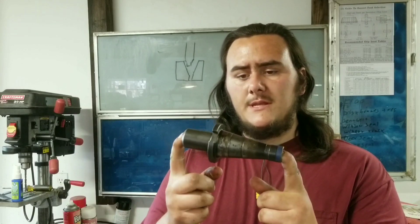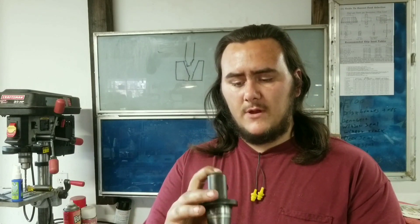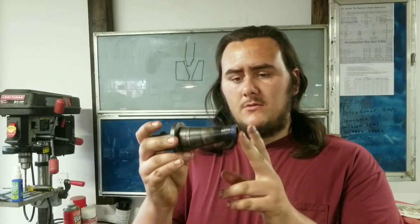With a 40 taper tool holder you would need two-and-a-half inch round steel to machine away and create the taper, and also for whatever feature you want on the end. If I can save a few hours of work on the Chinese lathe, then why not?